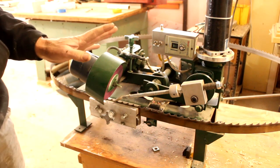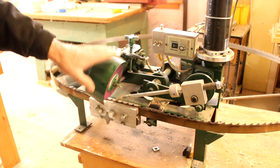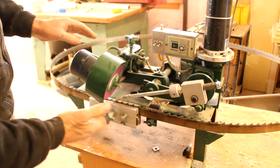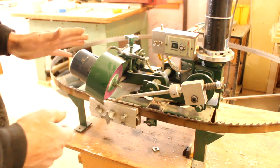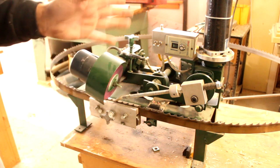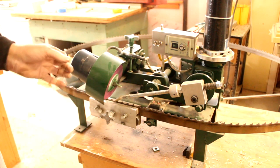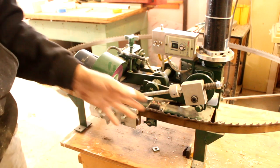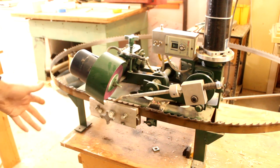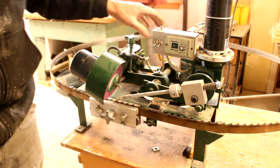Okay, we're ready to go. There are a couple of adjustments. This knob adjusts how far down into the cut the stone is going to go. This knob over here adjusts the feed into the stone, so you can get either the front or the back edge. They advertise these that you can do the whole profile at once — I have not found that that works very good. I can get it once in a while, but when these blades come from the factory they are not ground as precisely as you think. It takes a few grinds before you can actually hit the whole profile.